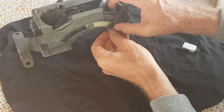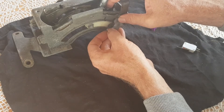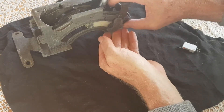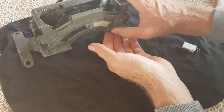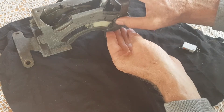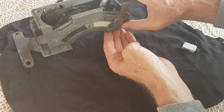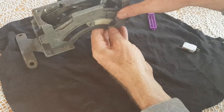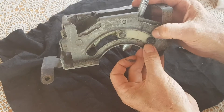Now, this will set in a few minutes, but you can put it in cold water or in a fridge. Once it's done, it'll turn as white as that piece right there. Believe it or not, it goes from totally clear to totally white. So what we're trying to do here is just mold a little bracket, and this little bracket is going to help to fit my switch on and mount to it. I can even screw into this, I can glue to this, I can do whatever I want. As you can see, it's already started to shape.